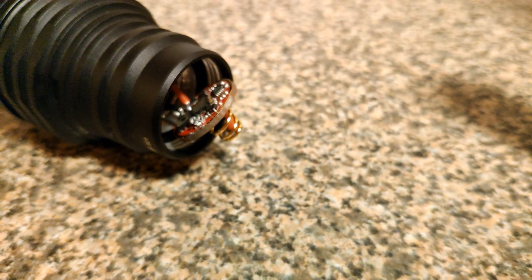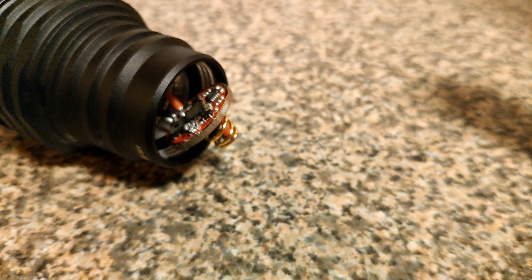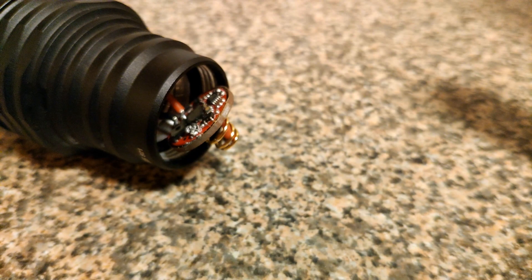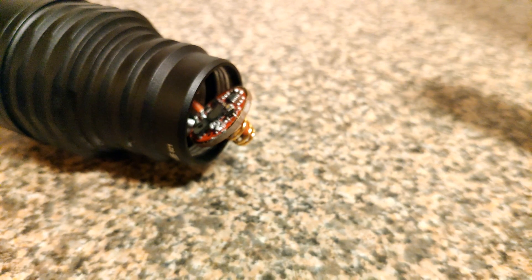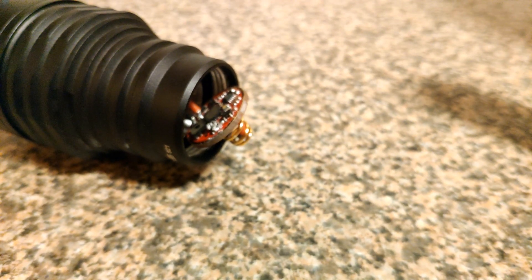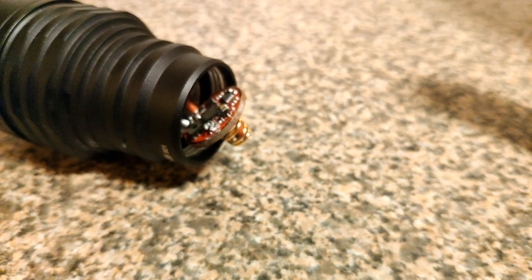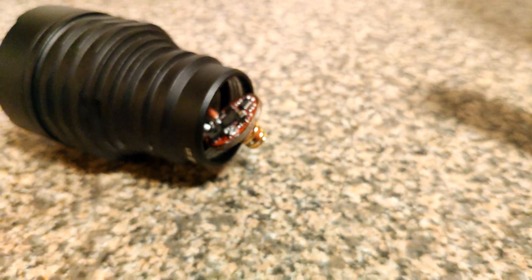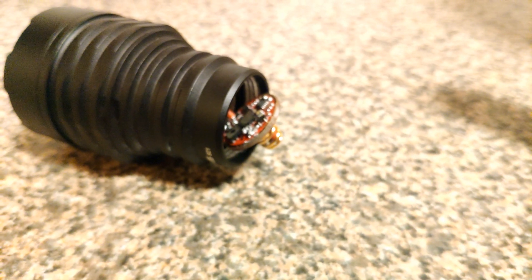I tested it — it does about 60 watts, a little bit over. At 60 watts, the 6-volt XHP 50.2 does about 4,850 lumens from output tests that I've seen. So I'm not saying this light will be doing quite as much, but I'm reckoning it's hitting around the 4,000 lumen mark somewhere around there. And as you can see, next to the L6 it was really, really bright. That's pretty much it — I hope you enjoy the video. As always, like and subscribe. Thanks for watching.